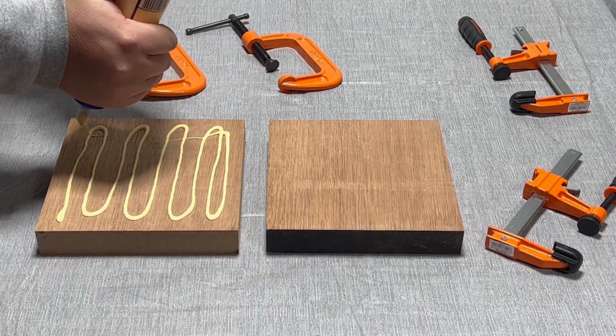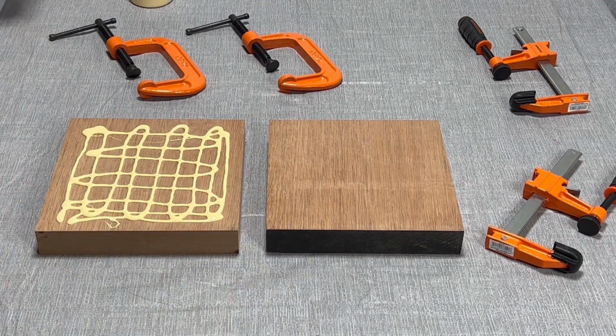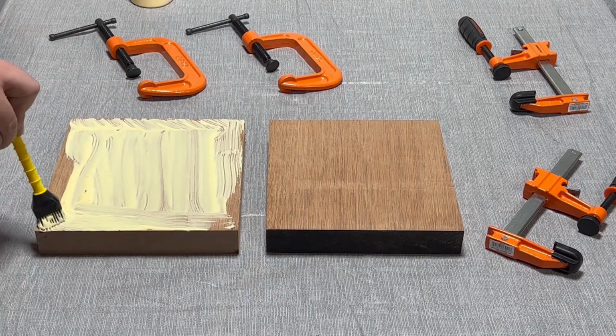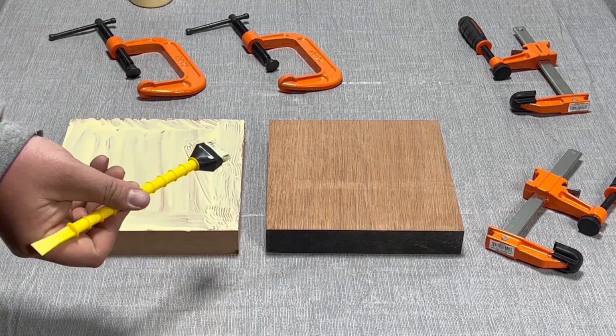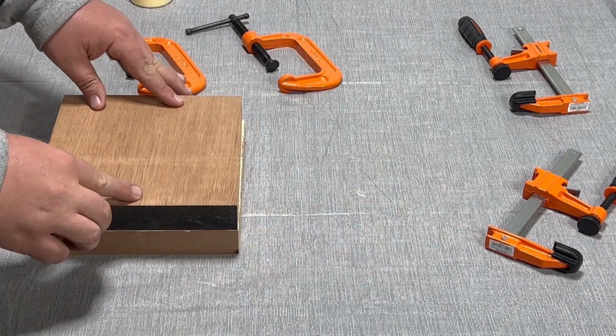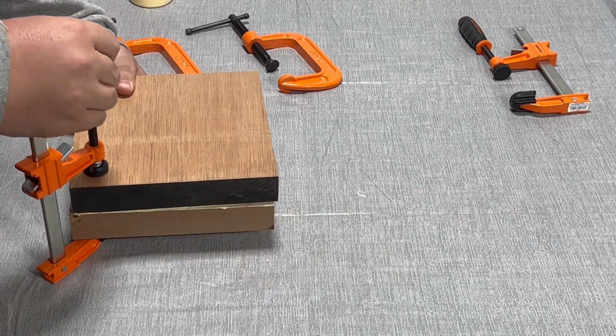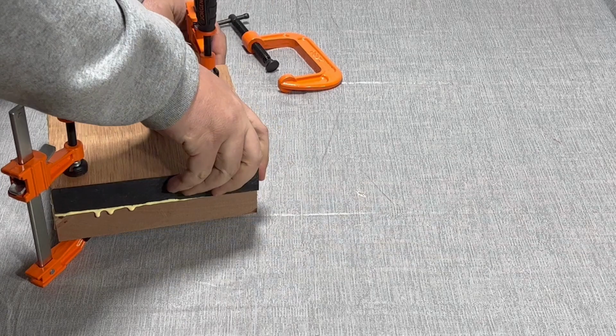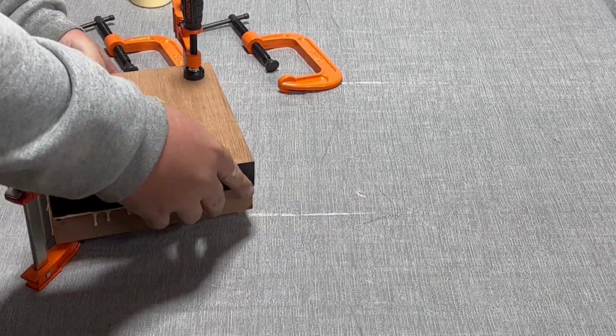For our next step, we're going to bond and clamp our two pieces of wood together. This will allow us to cut a circle of our desired thickness. Be sure to keep all of your wood grains running the same direction. This will make your bonded board appear more seamless. It's also important to apply equal pressure on all sides while bonding.